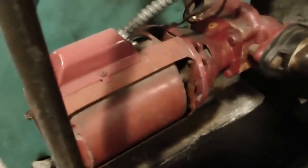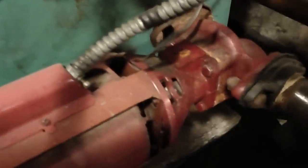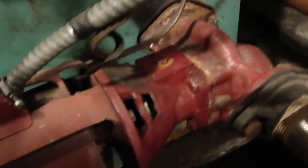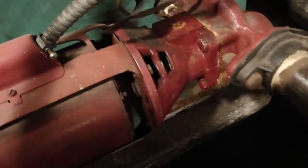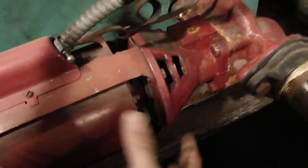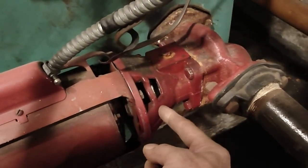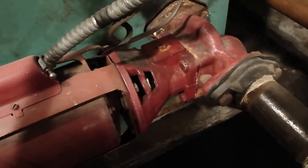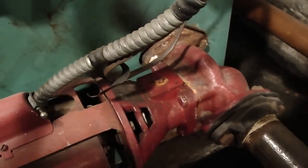What we're going to do is take off the motor. There are four bolts here — one here, one here, and two on the opposite side which are going to be kind of tight to get at. We're going to take these four bolts out, remove the motor, which will expose the inside of this housing where the coupler and motor mount is housed.